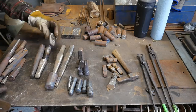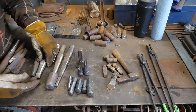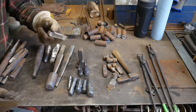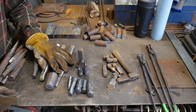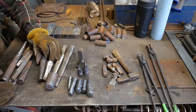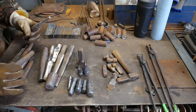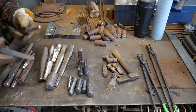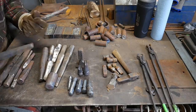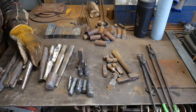I decided to make several different size hammer eye drifts out of H13 as well, because it's going to be a lot more robust than something that thin. Now I've also got stuff like this slot punch — it's mint, held by a big pair of tongs. I ended up liking a slitter-style punch a lot better — it's more like a rounded-edge chisel, and I liked the way it slits through material quicker. And over here I've accumulated odds and ends of mild steel drifts and tooling — that's perfectly fine as long as you're engaging hot steel with a cold drift; you won't get much deformation.